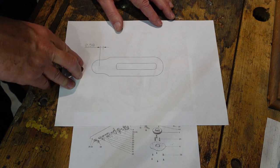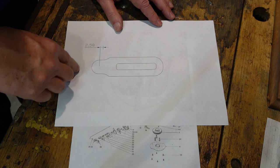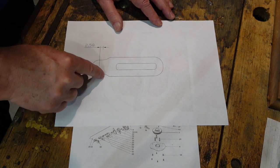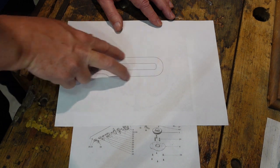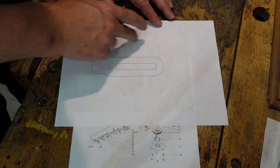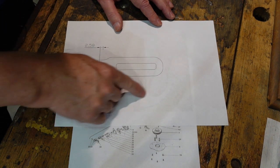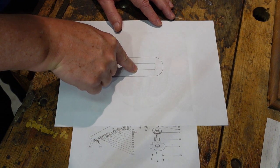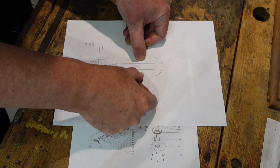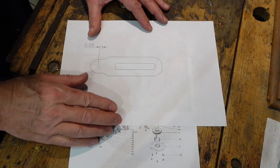Having lots of photos does come in really handy. Once I've got those dimensions, if it's a part with aesthetics to worry about, I'll draw it out in my CAD package - just an AutoCAD thing. If you've got a 3D modeling package you can model it up and check it looks right. In this case there are some scallops where the width is reduced, and I wanted to find out where the center of my radius is and how that's going to work, because I'm going to set this up on a rotary table for the machining.